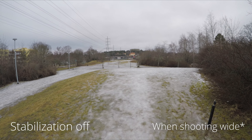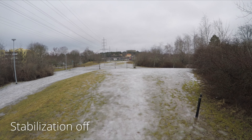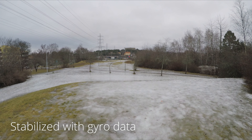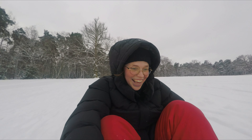The camera does have electronic stabilization, which crops the video 10% and stabilizes your footage — though it's nothing amazing, and note that it isn't available in 4K. It doesn't have HyperSmooth like the newer models, but it does record gyro data so you can essentially create your own HyperSmooth in post with more control using Gyroflow. For some shots you might not want stabilization, and for the ones you do want stabilized, you can control how much. I will release a video on how to do this and will put a link in the description once it's out.